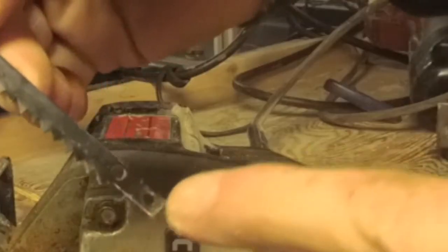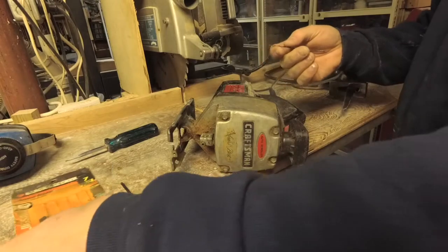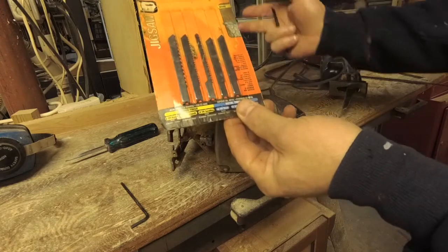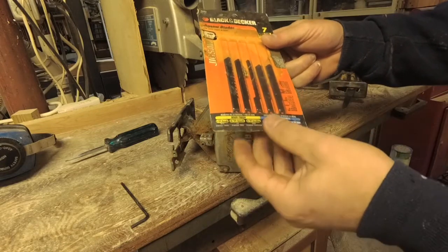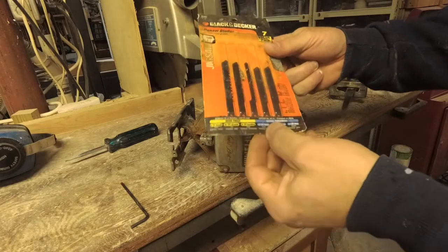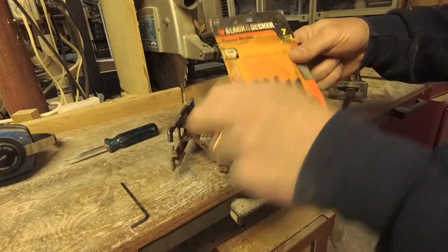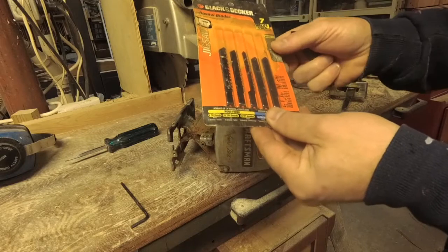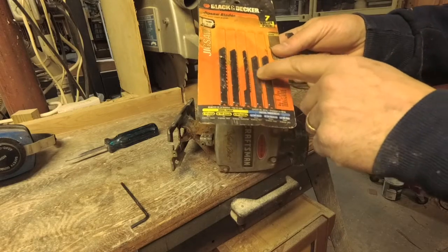There's the blade itself. What you're doing is catching this hole right here — when you tighten that screw down, it catches right inside that so the blade can't just fly out. There are several different types of blades you can get for scroll saws. This is an inexpensive Black and Decker kit. You can get all different brands — good ones, cheap ones. This is probably low to medium quality. You can see the teeth counts are different on them and the width of the blade is different. This thinner one is great for going around tighter corners or doing more fancy scroll work, and then you get some finer teeth that are designed for cutting metal.